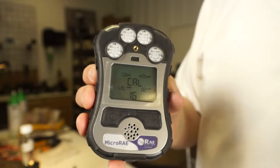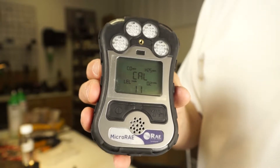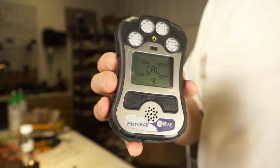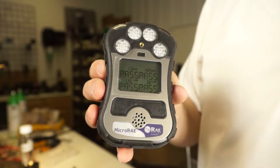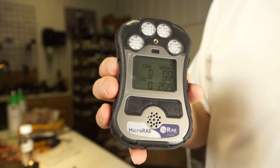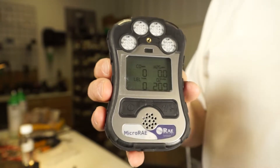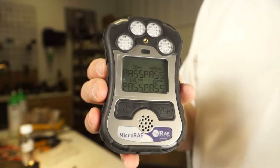If you have a situation where you're not sure of your background or you know it's bad, then you don't want to do that. Because if we zero out a positive number, the instrument certainly will do that — and then when you actually seek and find fresh air, you will get a negative reading. You'll typically see that on your carbon monoxide. You don't know if there's carbon monoxide in the environment, you take a positive and make it zero, then when you go outside to fresh air or upwind from a vehicle, you will all of a sudden see a negative number. That's a good indication that you had zeroed in a contaminated area.